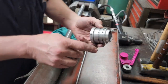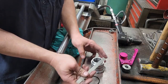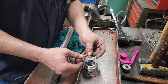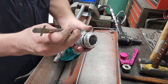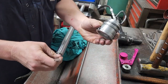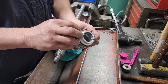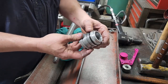Starting with the bottom groove — which is a 1-series size O-ring for a 2-inch bore — start with the backup. It has a concave on one side; I'll put it on first and just roll that around until it's seated. Then I'll take my O-ring. This backup is concaved on one side to seat the profile of the O-ring. Put the O-ring on — that's it for the outside.